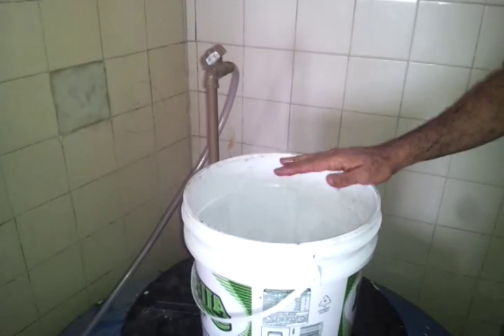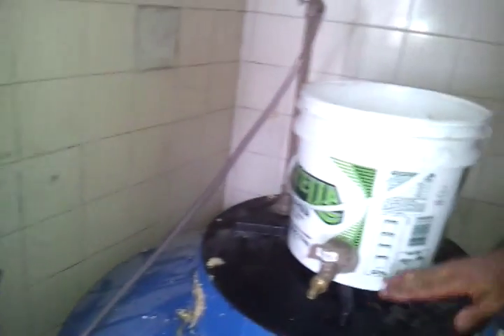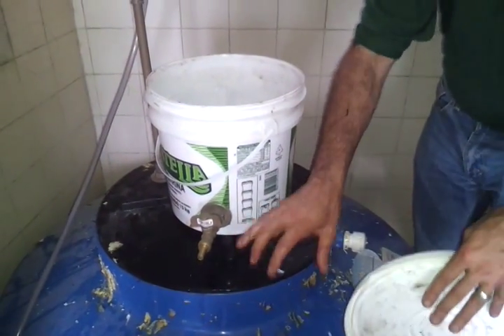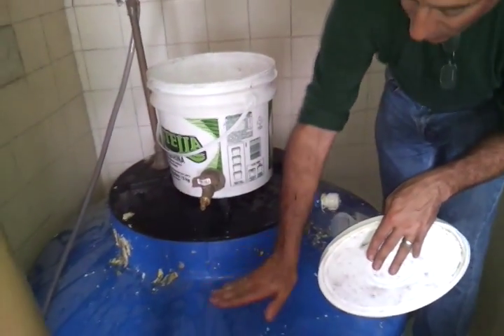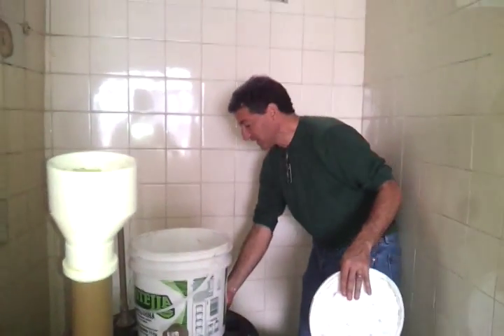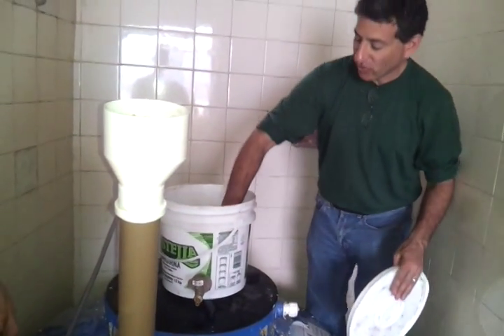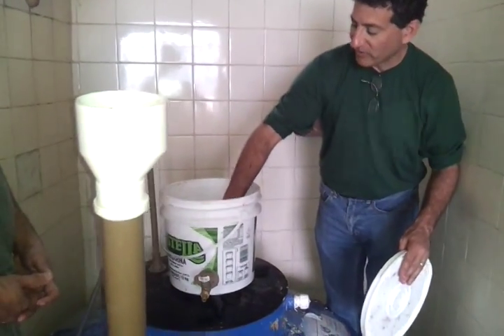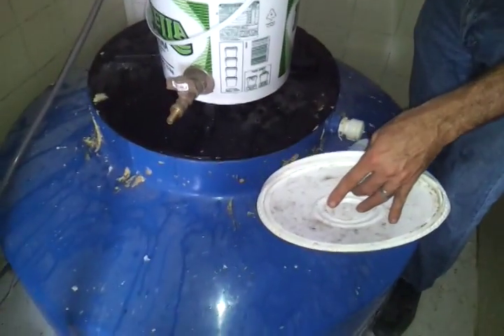The liquid fertilizer goes out until your water level drops. You've got this filled with water, then gas is going to be produced by the bacteria. It's going to rise up and begin putting pressure on the water downward, which is going to lift the gas from the center and start filling this bucket. This bucket will fill with about 10 to 20 liters of water when there's 10 to 20 liters of gas in here — and that's the maximum.